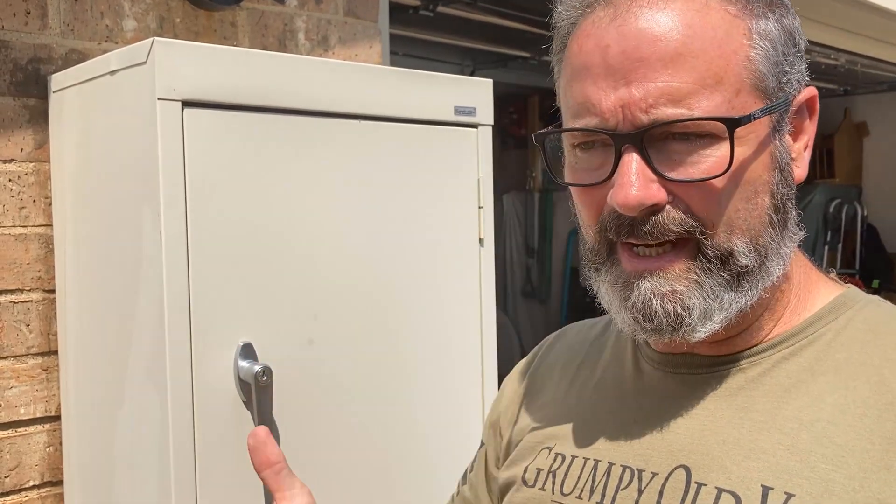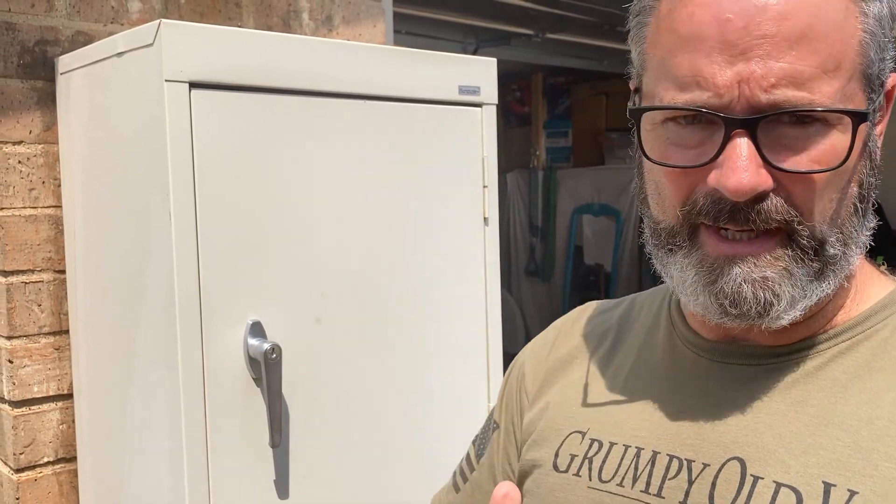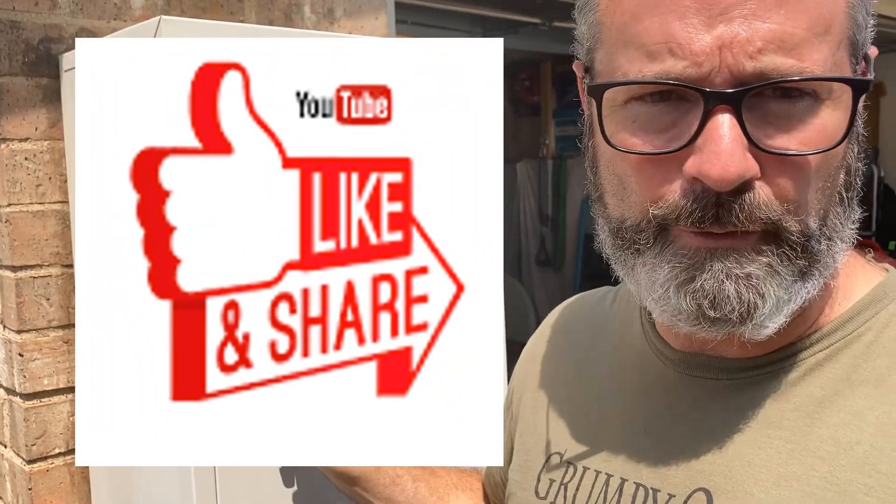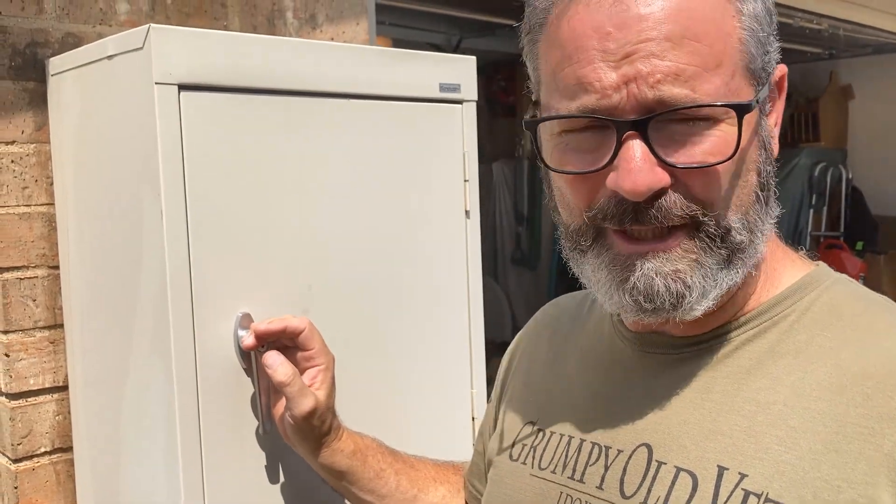So there you go — specs, money and checks, location, GFCI protection. If you can knock out those things, you're going to be in a good way for making a plan and figuring out what you're going to do and how you're going to run your 220. Generally speaking, I wouldn't do this myself if I was not an electrician — there's enough power that it's worth it to be safe. You also need to know about wire sizes, ground wire sizes, and conduit sizes. In most places, when you're doing a 220 like this, you're going to need to pull a permit. We just crossed 3,400 subscribers and we're working on getting rid of ads. So tell me what you think about your 220s and what you've got going on.